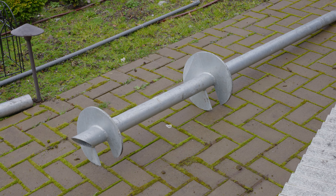Today we are driving helical piles. We are running a special helical pile that we've never used before. It's to obtain a greater pressure per square foot so that we can get the correct loading capacity that we need for this particular deck. We're running a double helix pile made by MassCore Helical Piles — it has its standard 10-inch round screw on the bottom, and then two to three feet up there's a 12-inch screw also welded to the pile. They're a little bit taller than our standard, but we have a little bit looser soil condition on this particular build, so we're going to try these out and see if we can obtain the pressure we need. We need 5,000 foot-pounds of torque on this particular build for these three piles. I hope you enjoy this video and leave your questions below.